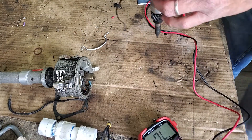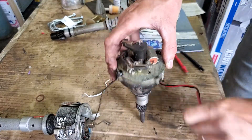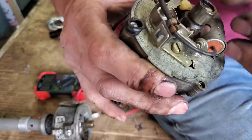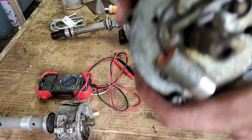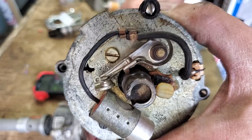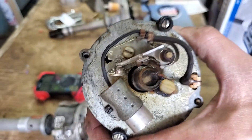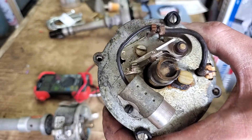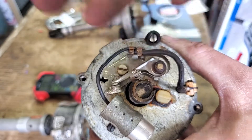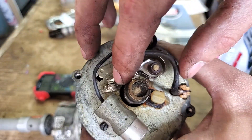I've decided to do this on the bench on a test distributor because it's a lot easier to film than on the boat where it's all angled. Here we have the same distributor that's in the boat — this is just a test unit. Watch these two points over here: they're going to open and close as I rotate this. That little heel rides on the cam shaft and keeps firing. This is basically just a physical switch — a points setup. Breakerless ignitions have various ways of performing the same function: a magnetic pickup, an optical eye with a beam. This is the old mechanical style — it's very reliable.